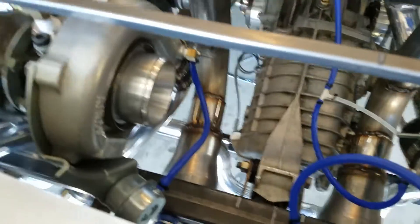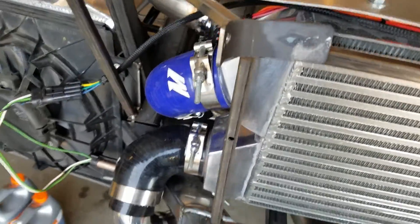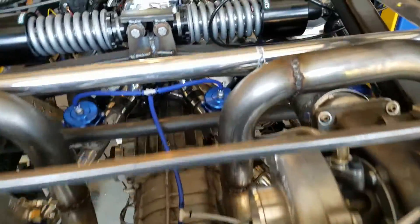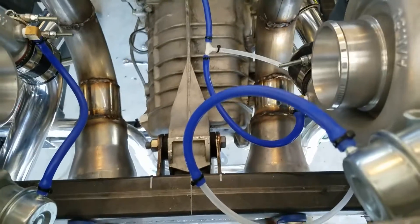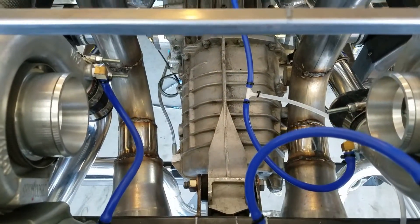In the meantime, what we've done is we've actually plumbed up our turbos through the intercooler. I've got a lot of clamps on there right now, but eventually what I will be doing is welding up some tubing and removing most of these clamps and connectors. But for now they'll suffice. It's a good thing to do when you're shaking things down before you actually weld up some tubing. We plumbed up our blow-off valves as well as the waste gates, so that's all plumbed up. And then I made plenty of tubing so that we can get our box in there, and I've got to do a way of mounting the box to the system.